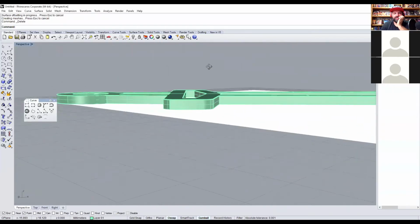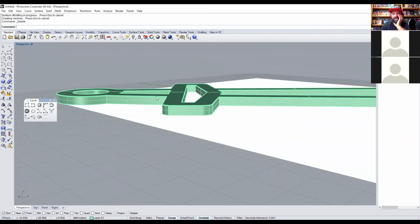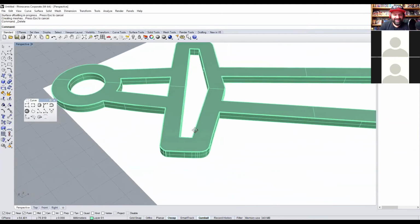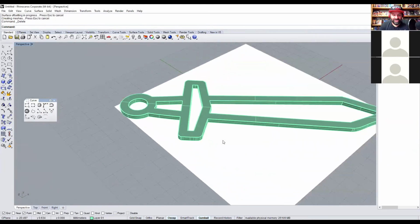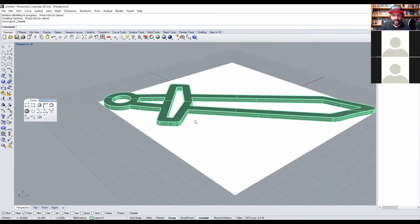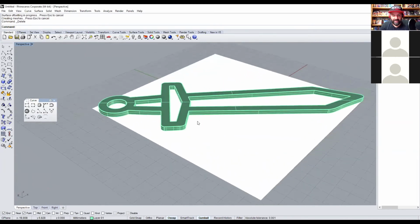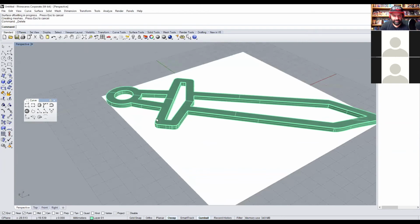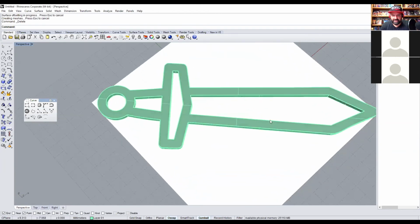So a lot of the polishers would just be lazy and polish the top, the bottom, and maybe the outside if you're lucky. Don't give it to them. Do it yourself. The way I would do this polishing is using emery paper, 320 on the outside, and the whole thing, just polish it nicely. And then the inside, I would use a very fine file.